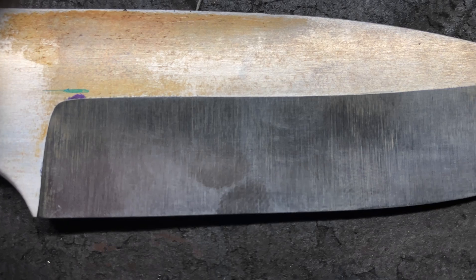One of the things I look at is: are these plunge lines even? Put that blade up there, look at the tip — is it coming out in the center? You want to do the best job you can, because you're selling your knives and putting out quality work. I'm watching all of that the whole time. I'll stop, look, make sure I've got this edge in the center, keeping everything square. Another reason I color these after each grit with a marker is to see my previous grinds, and also when you go to hand sand, this will be a breeze because you won't have any big gouges or scratches in there.